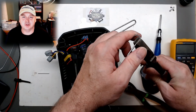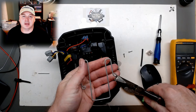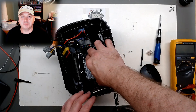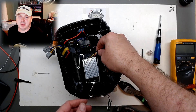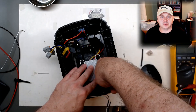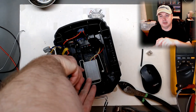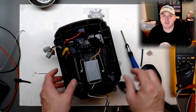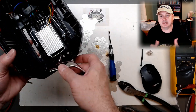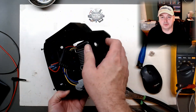Here I'm just taking a clothes hanger and bending some wire. I decided to use the wire as a capture or retention device for the heat sink and controller. I'll put some foam in there to keep everything spaced off, and the spring action of the wire will be nice and neat — it'll also add a little bit to the heat sink rather than impeding airflow. I used the same heat sink from the old controller on this new controller, which doesn't come with one.